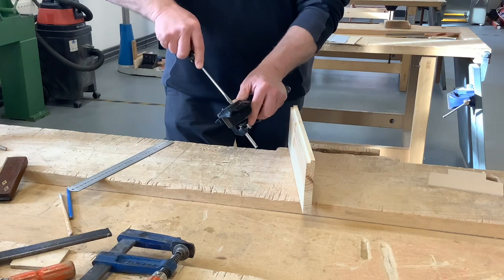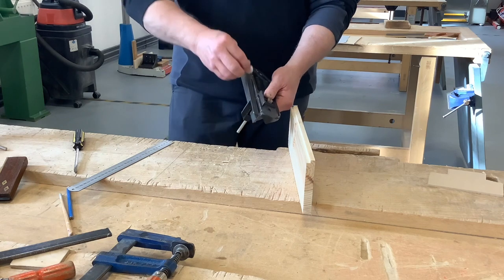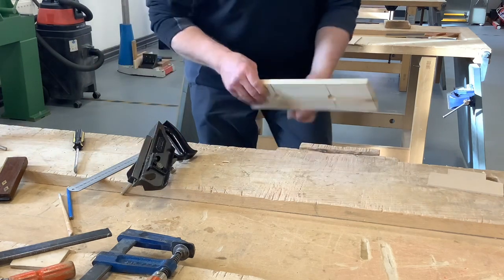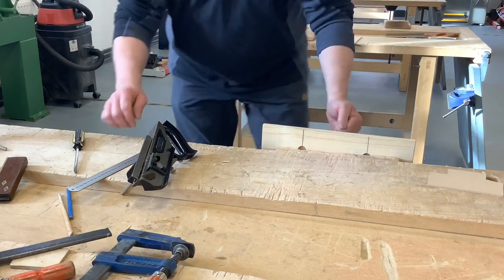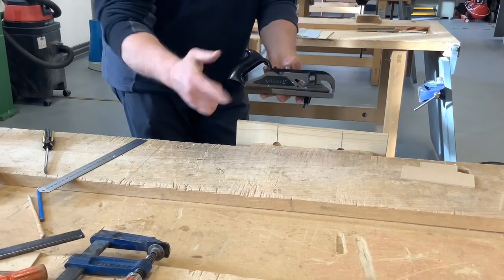Check it, make sure it hasn't moved. Give it a final tighten. As before, I'm going to put some wax on it — this helps the plane glide over the material more easily. Then I'll clamp my material in the vise and make sure it's good and tight.